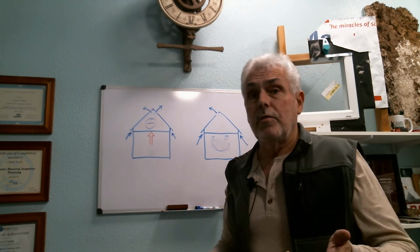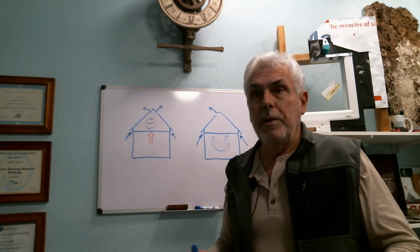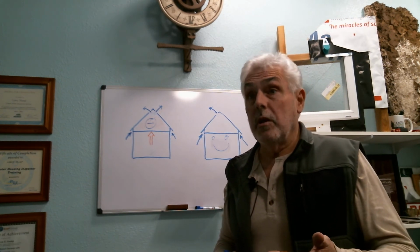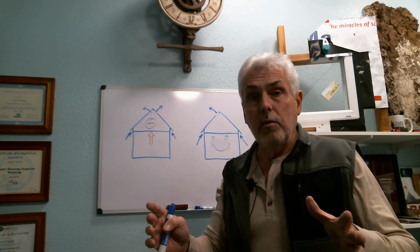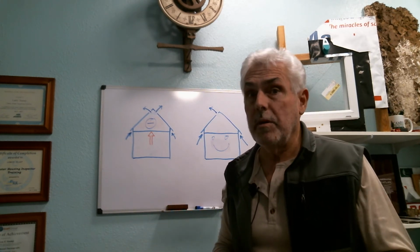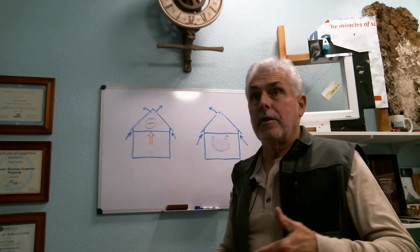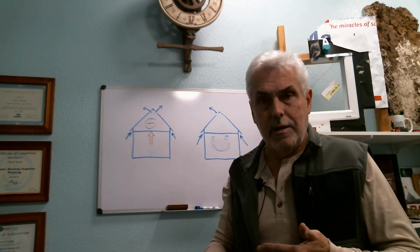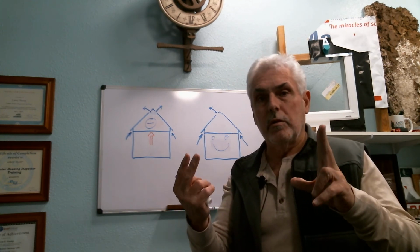You see relative humidity issues all the time. Mold up in the attics, mold everywhere. Well, people aren't using the exhaust fans. They don't leave them on long enough. Sometimes it's a matter of saying, hey, let's move to a higher end unit like a Panasonic. Let's put it on a humidistat so that it's not left to human intervention to remember to turn it on and turn it off at a certain time. So those are factors that can culminate in more moisture load on the structure.